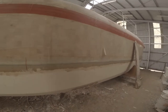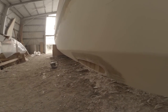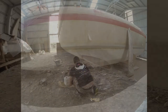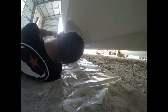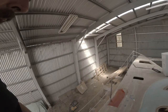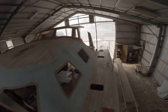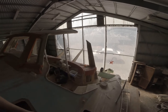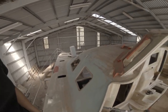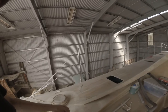I'm not particularly looking forward to the job I have today — I'll be lying down here glassing these daggerboard cases in. Not fun, but it needs to be done. The daggerboard cases are tabbed in place now, both upside and down. No more lying in the gravel getting epoxy in your hair — well, for a while at least. I'll let them cure up before I can add some extra glass at the back ends, because that was not going to happen without moving all the other glass.